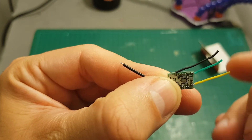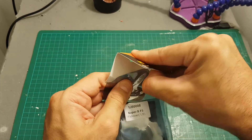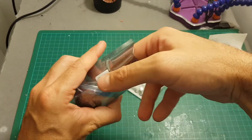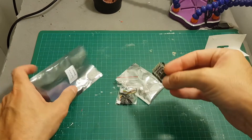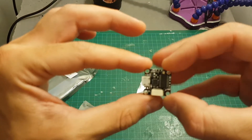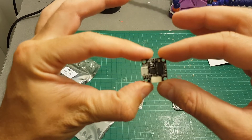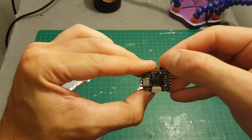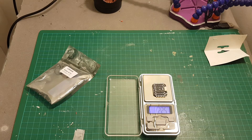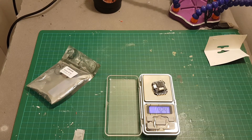Finally, the Super SF3 flight tower. There is a new F4 version which costs almost the same, so if you're buying it, go for the newer version. Inside the bag we get the four-in-one six-ampere ESC controller, all the necessary screws, and the flight controller, which has a full-size micro USB port for configuration. The hole spacing is 16 by 16 millimeters, so it fits our frame perfectly. The ESC weighs 2.25 grams and the flight controller about 2 grams — both together about 4.25 grams.